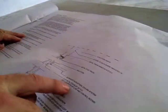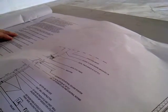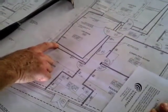Let's see right here, the 1A is full height. See, it's 2.5-inch studs at live and control room. Wait a minute. Use 3 5/8 studs at live and control room. Now, why is he contradicting himself? Oh, I'm talking about 1A. See, it's kind of contradictory, or I'm just not picking up on it correctly.